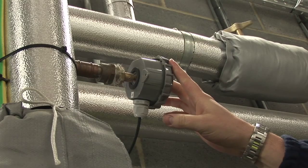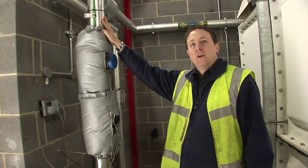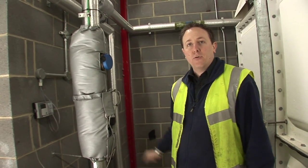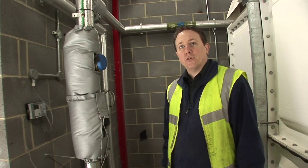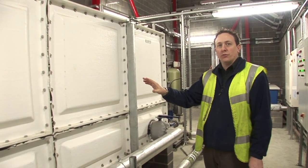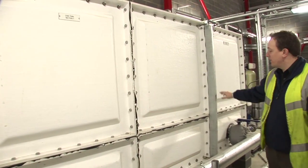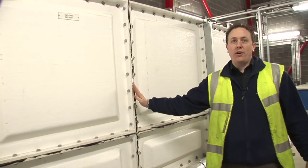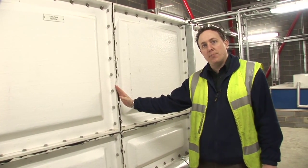Cold water service temperature sensor, and from there the mains cold water serves the rainwater harvesting tank room and also the main cold water storage tanks. Potable and non-potable cold water storage tank split into two sections, section one and section two, with an internal divider to allow tank maintenance during cleaning and chlorination processes.